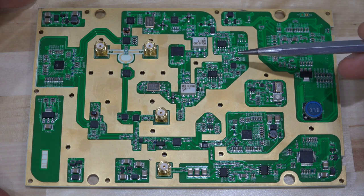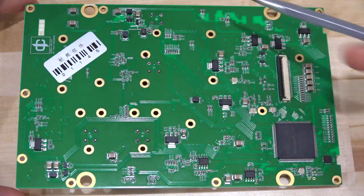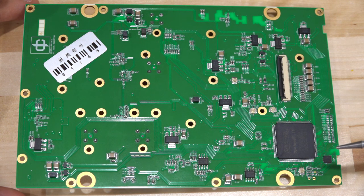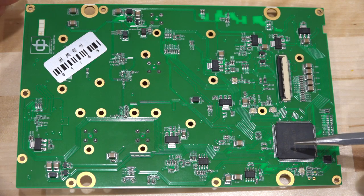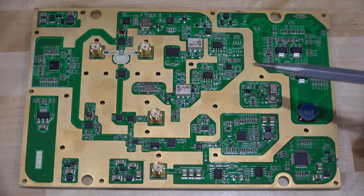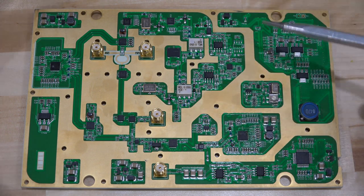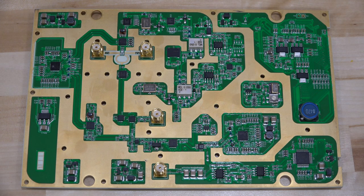The IF is generated at the end of the chain. On the back of the RF board, there are voltage regulators, the connector to the other board, and an Altera Cyclone FPGA. I don't see a dedicated ADC, so I suspect the ADC is implemented within the FPGA — possibly a Delta Sigma ADC, which is feasible in an FPGA. Component markings haven't been rubbed off, so everything is identifiable and replaceable using off-the-shelf parts.